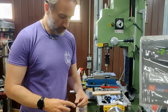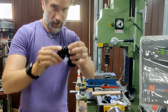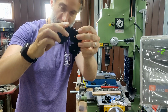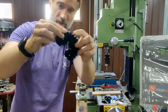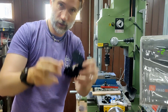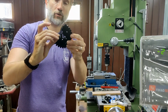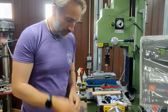So there are a couple of things. The first thing that's obvious: this is one of the fractures, right? It appears right at the corner of this nice sharp internal corner, and anyone that knows anything about these things would have told you that was obviously a weak point to start with. It actually exploded in essentially three different places, all of which were the internal corners of that section. And that section is there for this cross piece to pin the gear into the axle.